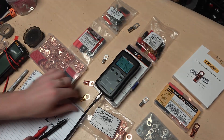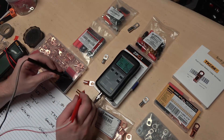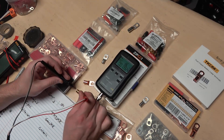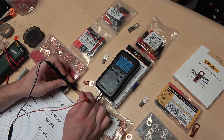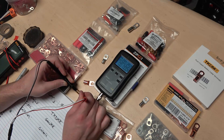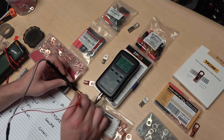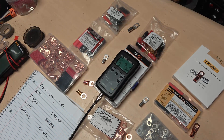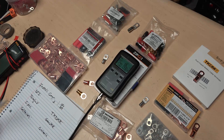Now I'm going to use the second Install Gear, which is the golden ring lugs — same measurement from the very inside. Wow, look at that difference — that's huge. This is the other type of Install Gear and it's reading 0.24 milliohms, a quarter milliohm for just the ring terminal. That's four times more resistance between just the two Install Gear types.